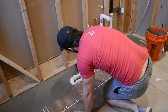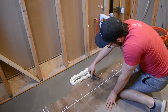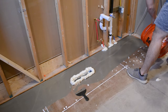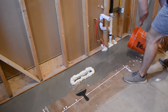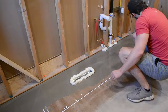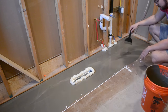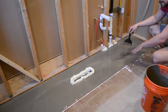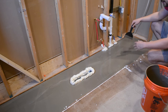While you're doing this, if there's a floor below you, it's best to check midway through to make sure you don't have any leaks. I luckily have a basement with an open ceiling, so I could verify — and there were no leaks. I was skeptical about how the Great Stuff dam would perform, but it worked really well, so I recommend it for larger voids. I made some Sharpie lines on the floor as a rough gauge to know where the cement should come to in order to make the floor level.